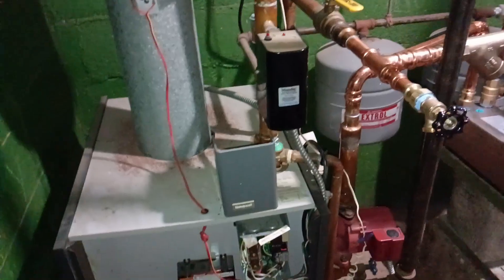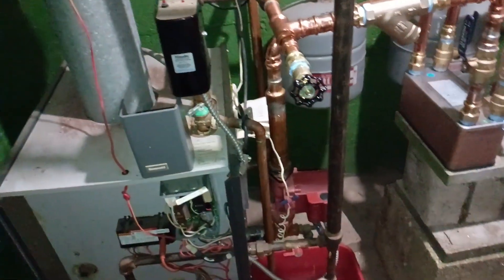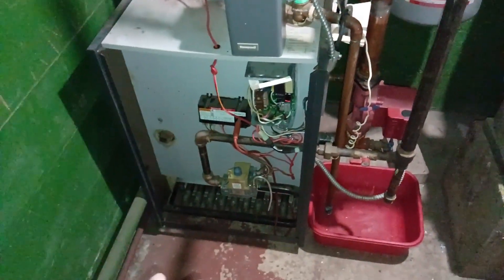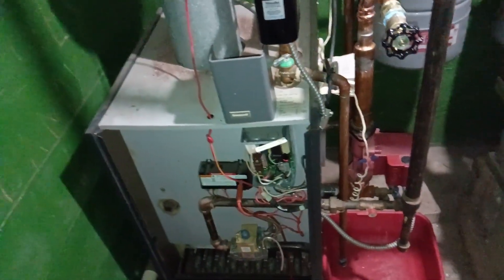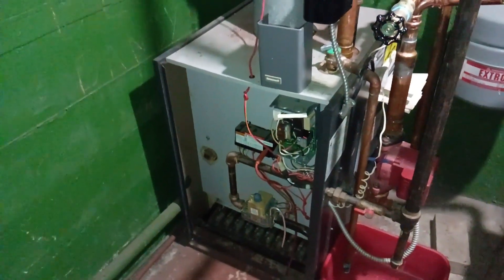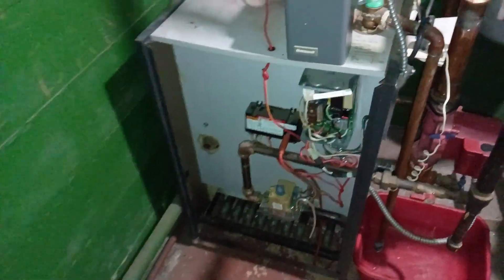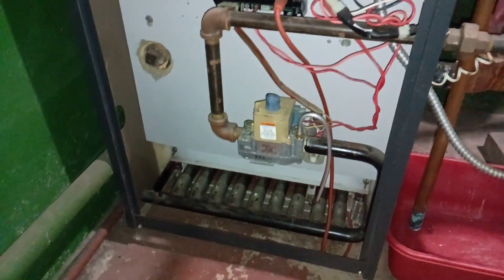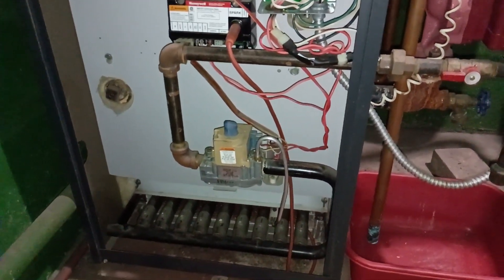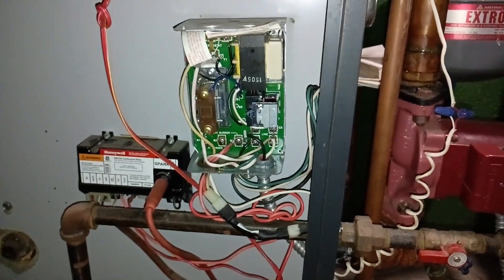If something has gone wrong and the house is calling for heat but not enough heat is coming from the outdoor wood boiler, and the temperature drops down to 140°F, then the boiler should kick on, fire up, heat the water, and maintain temperature in the house. That would mean a little less heat transfer — if we're normally distributing around the house at 180–185°F, distributing at 140–135°F is significantly less — but we're not going to freeze the house. So it works well as a backup system. This is a very old controller, but it's a function present in pretty much all modern boilers too.